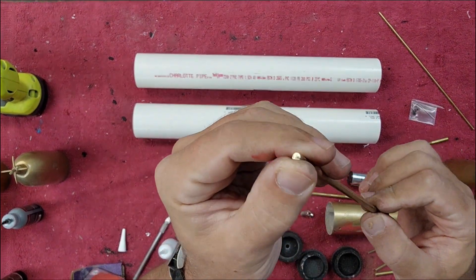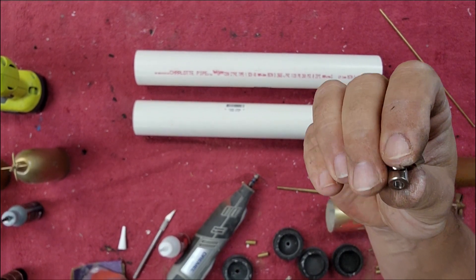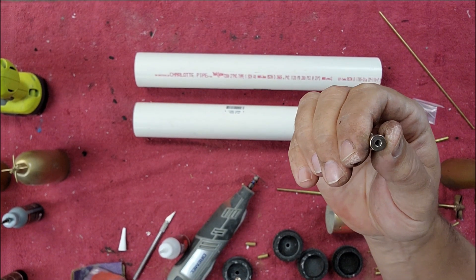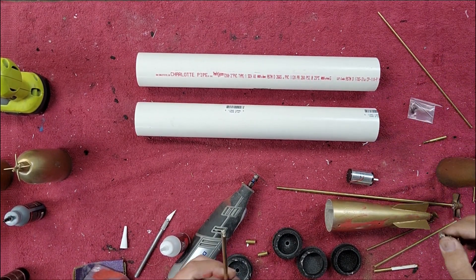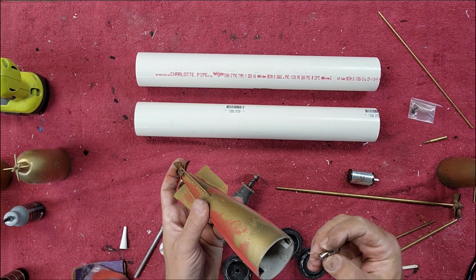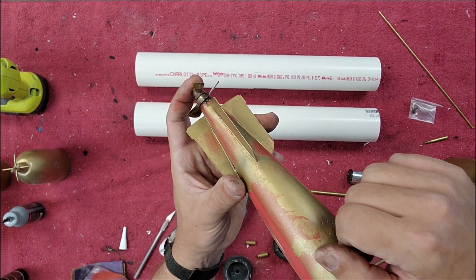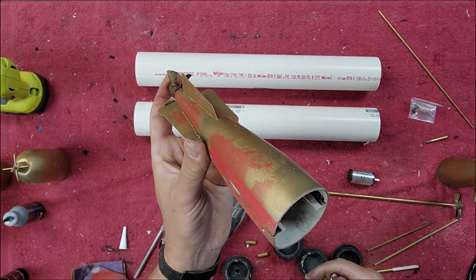I've machined a little flat in the end of my driveshaft. I've got a couple of universal joints — these are plated, they're not going to rust. It's 3/16ths on one side, which goes on the drive shaft, and one-eighth on the other side, which is basically an adapter. It's going to go through the bulkhead, through the seal, and attach to the motor. We're going to insert this in here, slip this on the end. In order to get to the set screw, I'm simply going to drill a little hole through the body so I can get my wrench on there and tighten it down, because this whole section is going to free-flood.